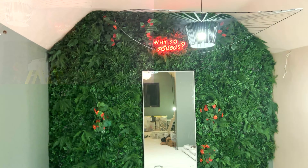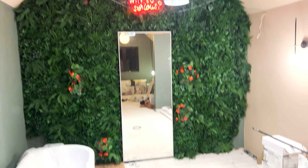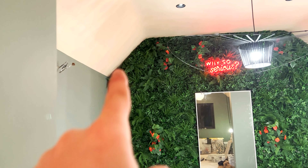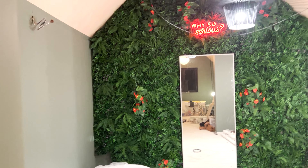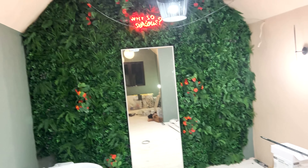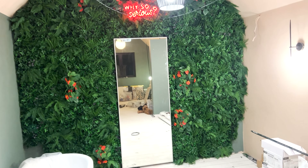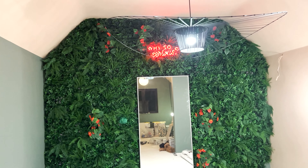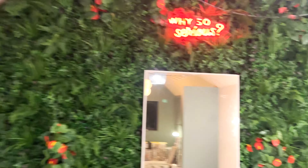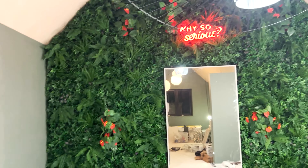That's all the panels on now. Just a little bit missing in the corners but we'll have wardrobes there anyway so you won't see it — I can live with that. The panels came together really easily: just cut diagonally down the sides and used a few off-cuts. It's just a case of screwing into the wall with little black plasterboard screws through holes at the top of each panel. I've just slotted any little bits that fell off back in to fill it out. I've also added a smart plug so I can turn the neon sign on and off with my phone rather than using a little remote that'd probably get lost.